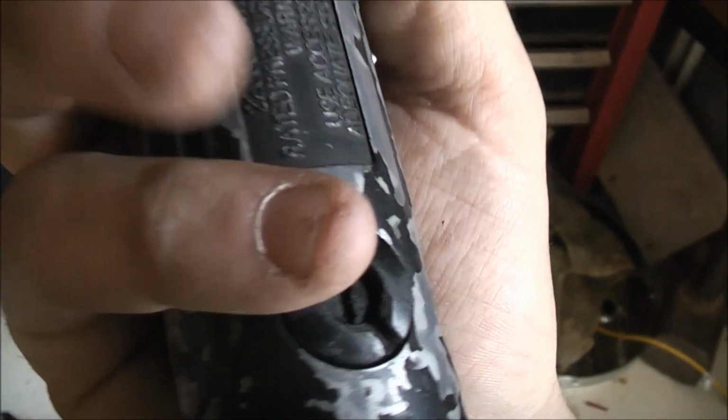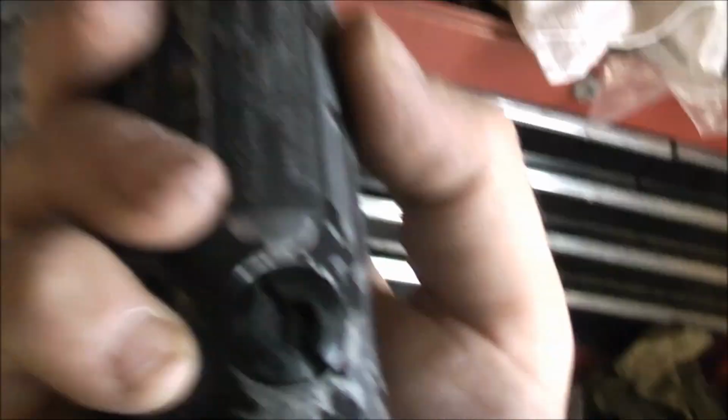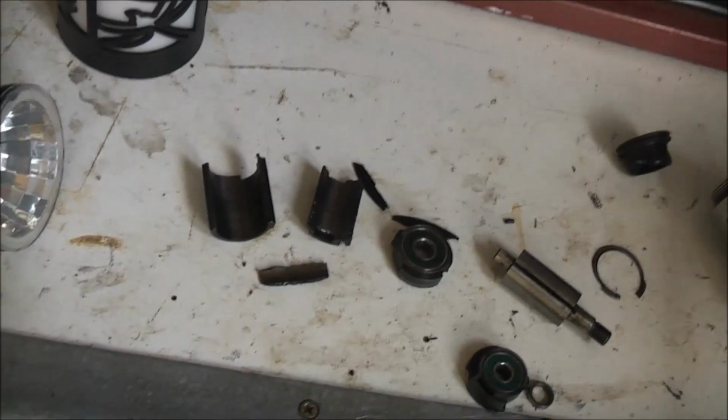Here's a Ross brand, made in Taiwan as well. You don't need a bloody Dremel, just use a good die grinder. You can adjust the speed by adjusting the airflow. They're much better built than a Dremel. Unless they burn out every year or so from using them all the time. You get a lot more use out of these than what you get out of a Dremel, that's for sure.